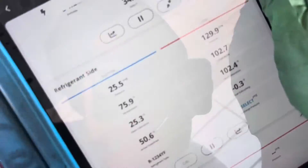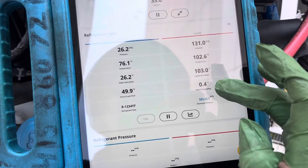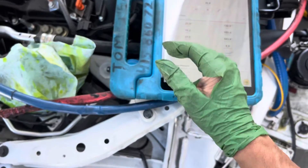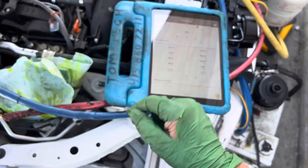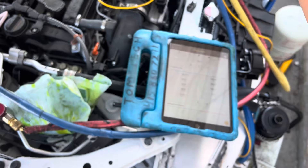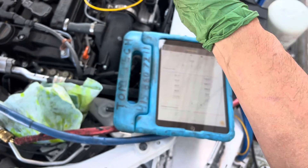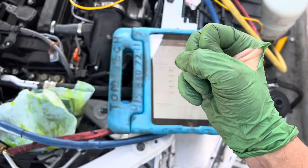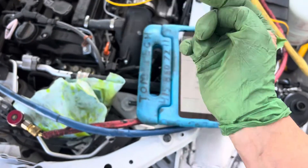I told him: look at that subcooling right there — that is not good. He had a subcooling near zero, something like that, and his superheat was high. I said forget the pressures — you need to add a little more refrigerant, because you added an evaporator, another expansion valve, and you have coolant flow going through there. Water has a much greater load-carrying capacity, the ability to absorb heat than anything else. Air is nothing compared to water.